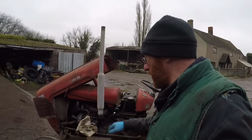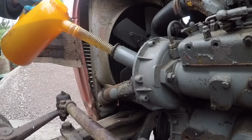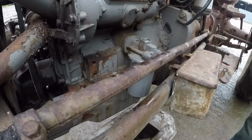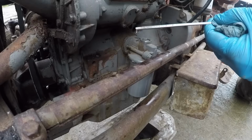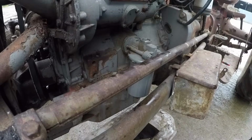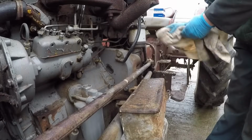So right, anyway, let's get filled up, and then we just have to change the fuel filter. Right, we're getting close now. So this is, yeah, we're there. You might not see that. It's very hard to see new oil on a dipstick, never mind on the camera. But right, we're on maximum. What we'll do, we'll let that sit for a bit while we change the fuel filter. We'll recheck before we go for the start, just while it settles itself out. So we will once again give the filter a wipe around before we start.